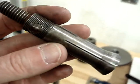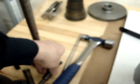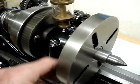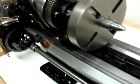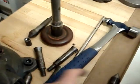You mentioned these might be 3C collets. I don't know what a 3C collet looks like. But I'm thinking what I'll probably do is see about putting a 5C collet chuck onto the back plate over there, and then just purchasing a set of 5C collets. I hear a lot about those collets and I've read that they're very accurate, so I'm thinking that might be a better way to go than try to salvage this.